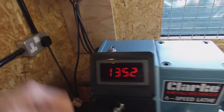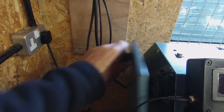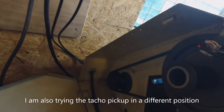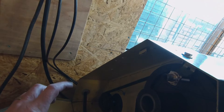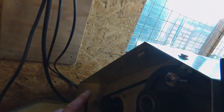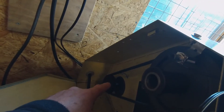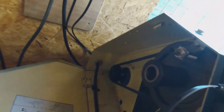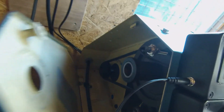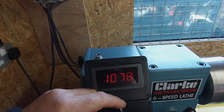I think it is this belt - can't get the tension quite right on there. I've got the interlock on this other belt by the way, on this rear. But it's bouncing a lot. I think I'm at the end of the tension, so I think I'm going to have to have a little bigger pulley at that end. I need to tie this down - I've only got a couple of clips of the cable down. But yeah, that's working okay, apart from the noise of the EMI.